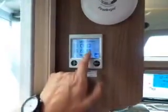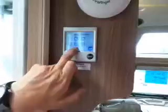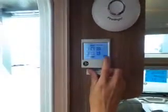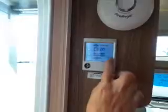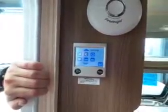After a few seconds it goes back to your main screen. Calibration is for the thermostat — if it thinks it's 30 degrees when it isn't, it won't allow the heating to come on, so you can calibrate it if needed. There's also a display setting: the normal setting is a bright screen, but you can switch to a dark mode for night-time running, as some people get disturbed by the glow. You can also invert the display. There's also a setting that, when switched on, will automatically boost the water temperature to around 60 degrees at about 2 o'clock in the morning to kill bugs like Legionella.